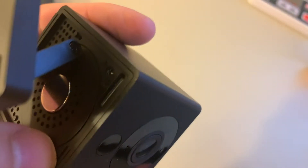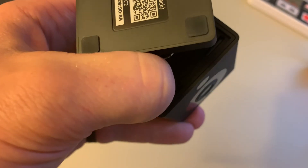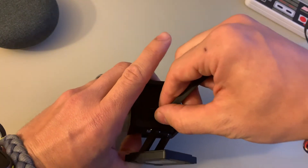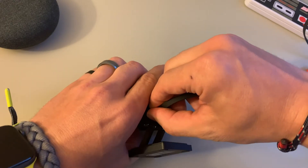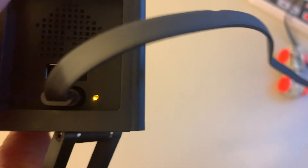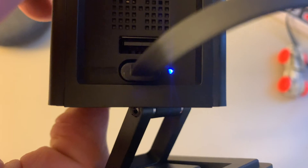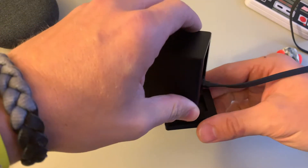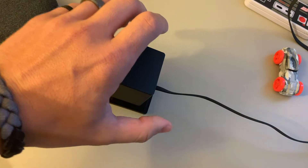The card is in, and we're all happy. Now all you need to do is hold down the power button, and as that's pressed in, plug it in. The light will turn on. Keep the button pressed down until it changes color, just like that. Now it's going to take about three to four minutes. It's going to cycle on and off maybe a few times, just depends. Then the light will start blinking when it's ready to roll, and we'll take it from there.